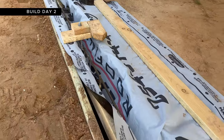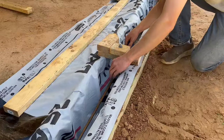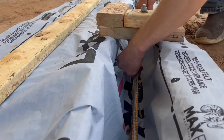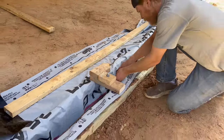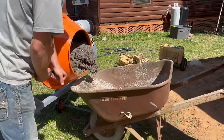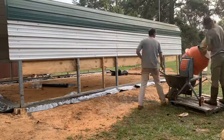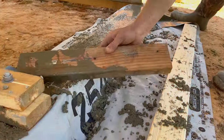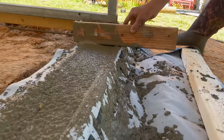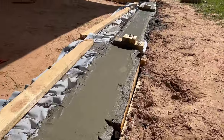We started the next day by attaching these bolts to our rebar and preparing the mounting locations for our front and rear wall. Mounting our front and rear wall to the foundation with these bolts will hopefully reduce any weight the carport will bear and reduce any chance of twisting or bending over time. To properly pour this much concrete in a timely fashion, this concrete mixer was an absolute must. After finding our groove, we spent the next eight hours and poured over 80 bags of concrete. Throughout the process, we continued to go back, level the surface, and make sure we didn't have any highs or low spots developing.